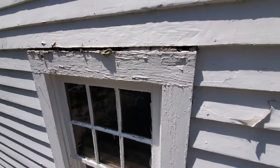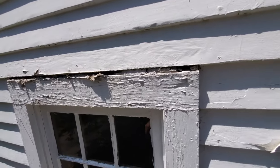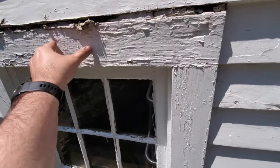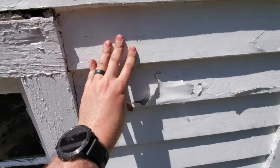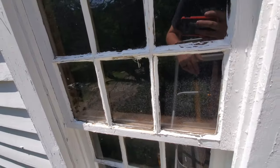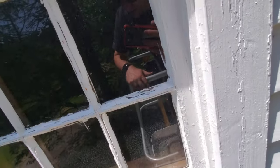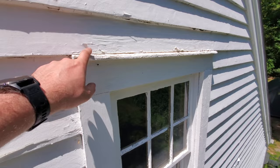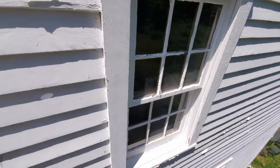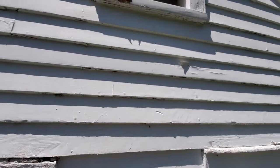Here I am at the attic windows. You can see this one does not have a drip cap at all - it's just got a bunch of caulking that's just falling out. I've got to pry all that out. The trim might actually be okay, but the whole thing is moving, it's not very well attached. I'm wondering if the whole wall is actually moving - I've got to check that out on the inside. The glazing is completely gone on this window. This other one is the same thing - drip cap is completely gone. I mean it's still there, but it's all rotten. The trim actually looks like it's in okay shape. There's a lot more work up here than I was expecting.